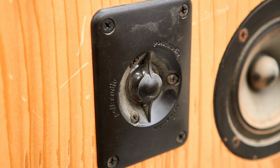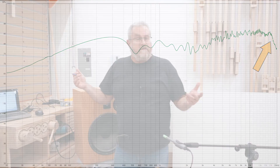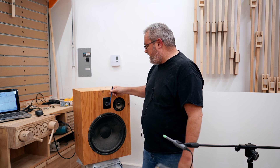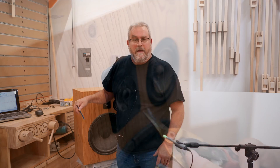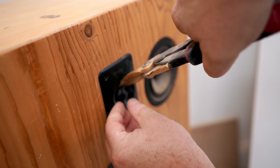It's a Polk Audio. You can see in the response that it dives down at around 18k, and we saw a very similar thing on my horn flare where it was rolling off up around 17k. Now this one has a phase cap on it, and I was thinking — because I don't think I'm going to be using these tweeters again — I could cut it off and measure it again to see if that makes a difference.